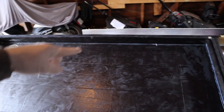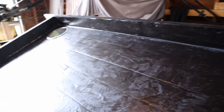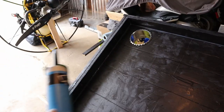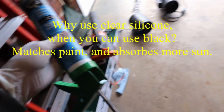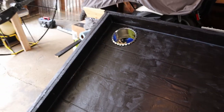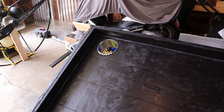That's why you come around with a high temp silicone caulk and you seal everything else, so air only comes in where you want it to and exits where you want it to. The caulk I recommend is a black 100% silicone caulk — it's 100% waterproof, costs five or six bucks. After you put in the starter ducts, you caulk around them to make sure air is only going in and out through your ductwork and not leaking anywhere else.